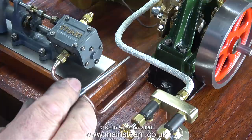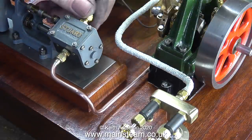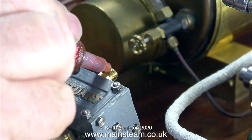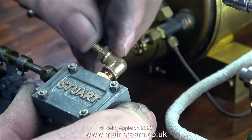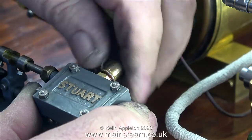The next part of the job involves making a piece of pipe to go from the turret to the steam inlet of the pump. Once again the threads on the pump are 1/8x40 threads per inch, using a standard coned union for 5/32 or 4mm pipe. While doing this job I realised it would be a good idea to fit the PM Research elbow and the adapter at this point — a bit of Loctite 542, and I'm screwing the PM Research elbow onto the steam inlet of the pump.